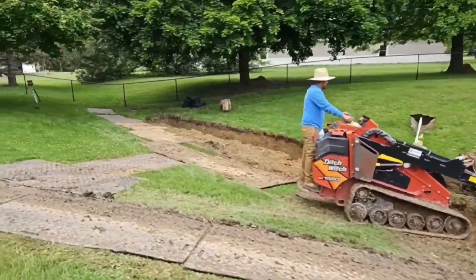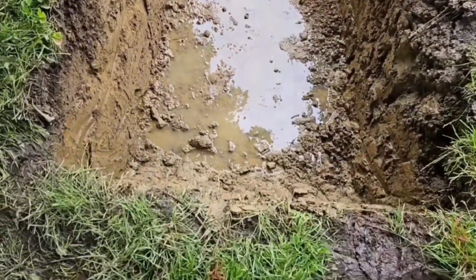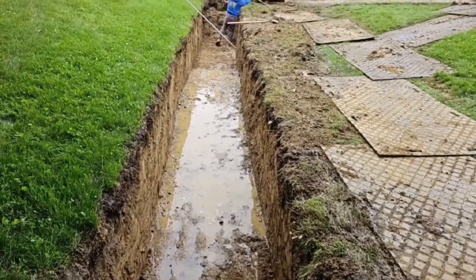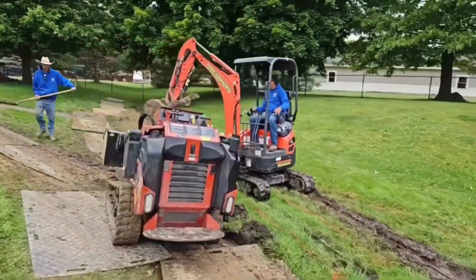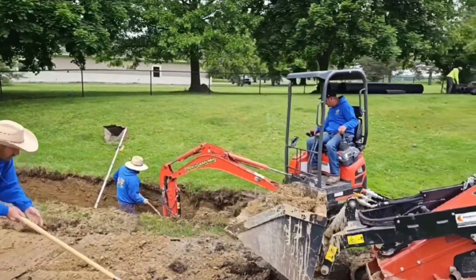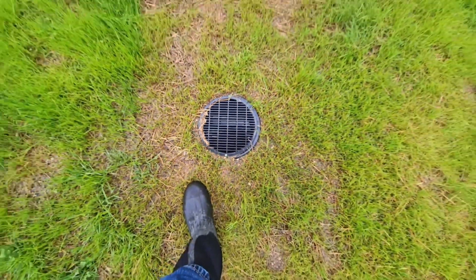You can see some groundwater in here already. You see that right there? It looks like there's an oil spill — that's telling me that water's coming up. There are minerals in the water. The water is right up to the top. The detention tank is full, pretty much — the water is just a couple inches below the grate.